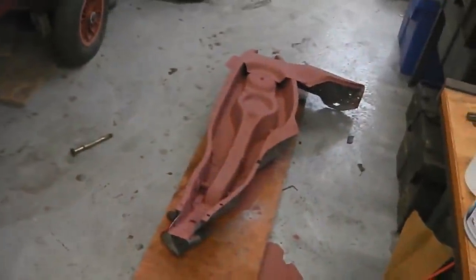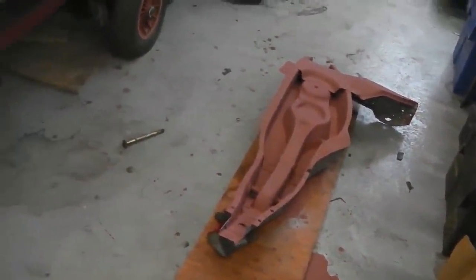We've got to drill some holes here for the plug welds. Again, the spot welder won't get in, so we need to drill out for the plug welds in the floor. How we get the markings of them is we fit the chassis leg, then mark round with a pen on the floor, take the chassis leg off and drill just inside of each line, so you'll get your 8mm holes for the plug welds just in the right spot.